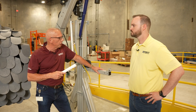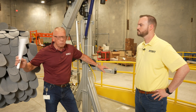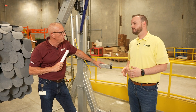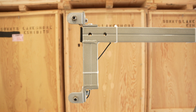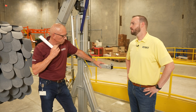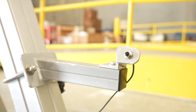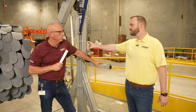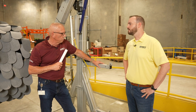Talking about the control side of things, I noticed that we have two sets of photoelectric eyes on this brush. Can you walk me through why we have two sets? So we have two sets of photoeyes. One is to activate the sonar sensor at the top of the equipment on the frame, and we also have a high hood set of photoeyes. When that beam breaks, it lets us know there's a larger vehicle approaching the brush and activates that 4-inch cylinder to make sure it's away from the grill.